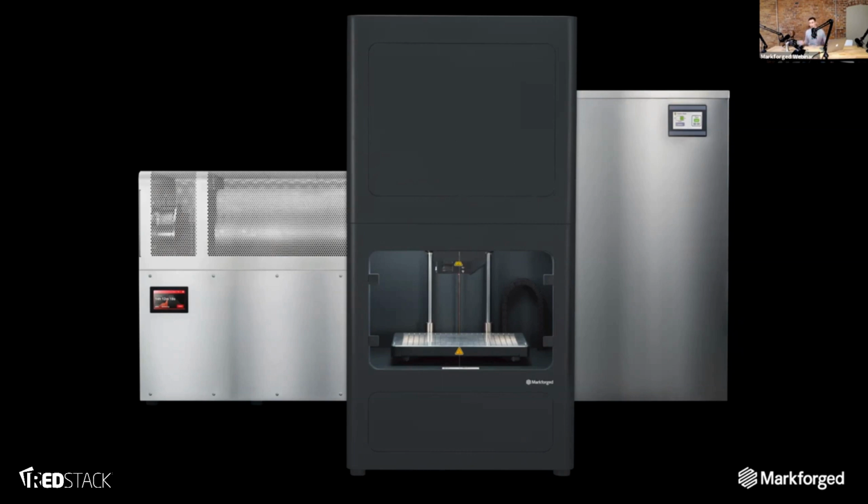And now it's rather ubiquitous. It was a rather unknown technology as recently as about 20 years ago. And what it is, you have metal powder encased, you heat it, you basically melt the metal polymer, you put it in a mold, you take that mold out, and then you post-treat it to make it metal.